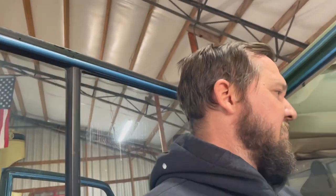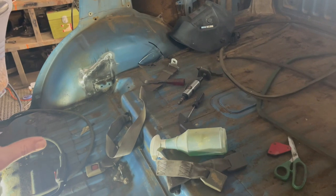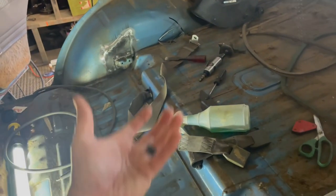So there they are - they're in. You can kind of see the shape of them and this guy's in. What I did was I just took the seat - I had some measurements as to where they were, but it's hard to hold them up there and measure. So I just snapped the seat back into the top rail and let it hang to get my height. Once you put the plate in there and coupled it kind of where it went, it was pretty straightforward looking at my pictures. I tacked them in, made sure the seat opened and closed real easy, which it did. So they're now fully welded in. I'm going to throw the back seat backrest back in and I think we can call that part done.